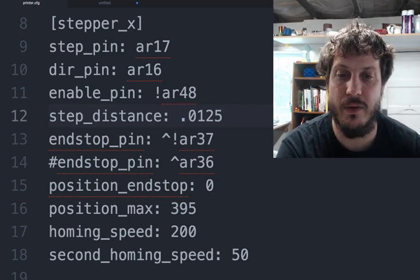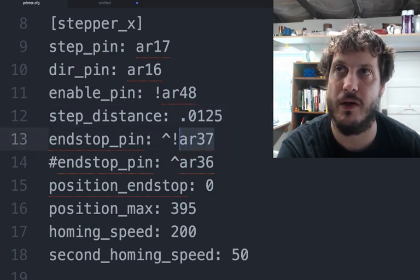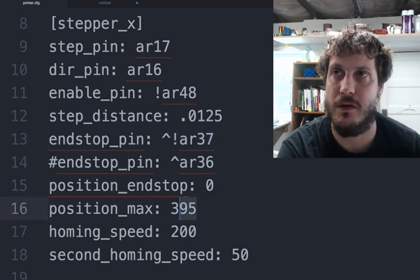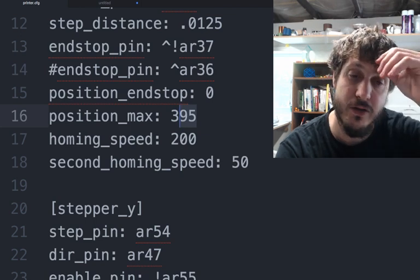Then as we go through, we have the end stop pin, and these are defined for now in the Arduino mapping, which we'll go over in a little bit, but you can use the native pin values, which you'll see as we get down in the description. The max position, just a regular Z max. Homing speed is actually set to pretty high intentionally.